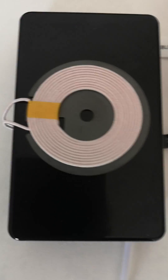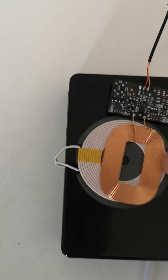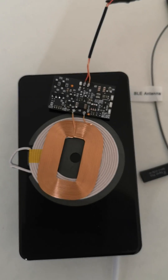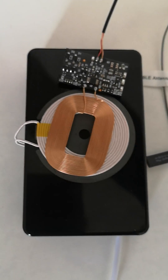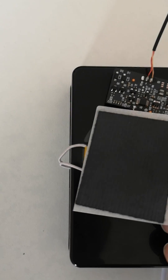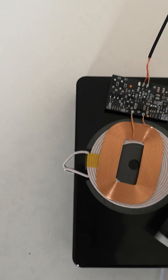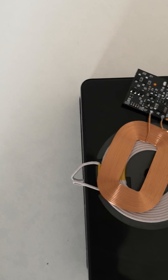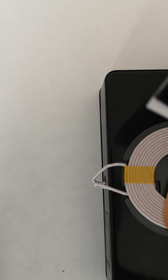It'll all be mounted inside a box and then I can just place it on the charger and even put my phone on there to charge it — it seems to work. Something that's important to improve the charging coupling between the two coils, which operates somewhere around 100, 200, or 300 kilohertz, is to add ferrite material. You put this piece on top — it's got a sticky back, that's why the paper's still on it — and that intensifies the coupling. There's one already stuck behind here on the box and that improves the coupling.